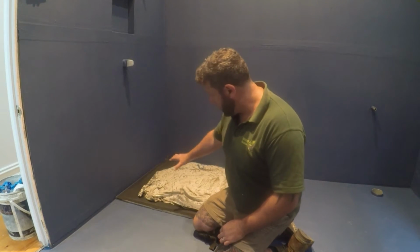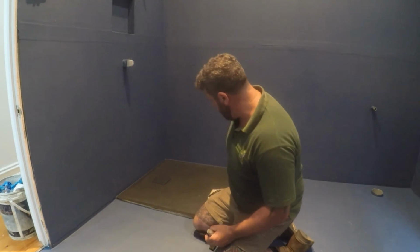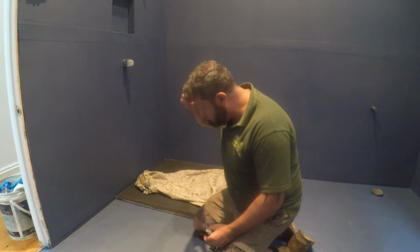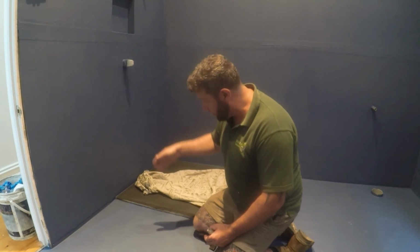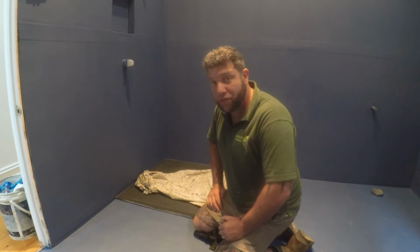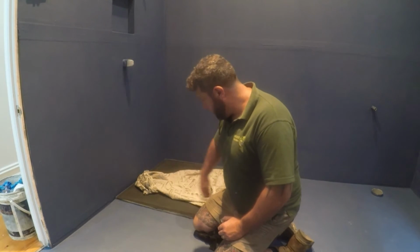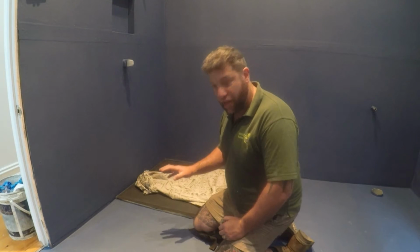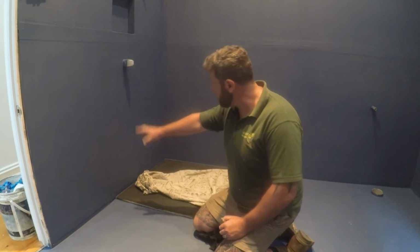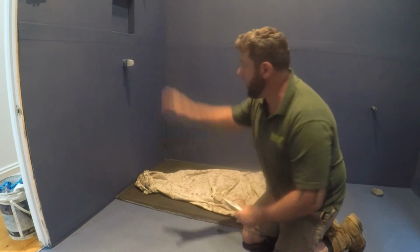I'm prepping over here the shower base. This is a pre-formed shower base that's already made, and I've embedded it in, but I've made sure that there's a little bit of an area around the edges where the water can get down underneath if it needs to. Under this tray is also being waterproofed as well. So I'll prep this and then I'll rerun tape around it, make sure it's just sealed up really well, and then I'll put some silicone on the external edges wherever these 2 walls are. So anything that runs down comes into there.